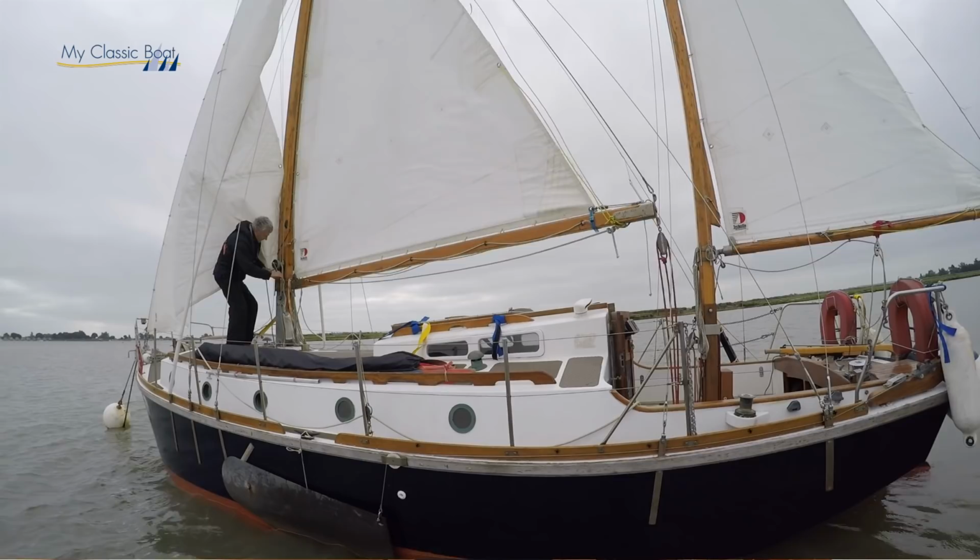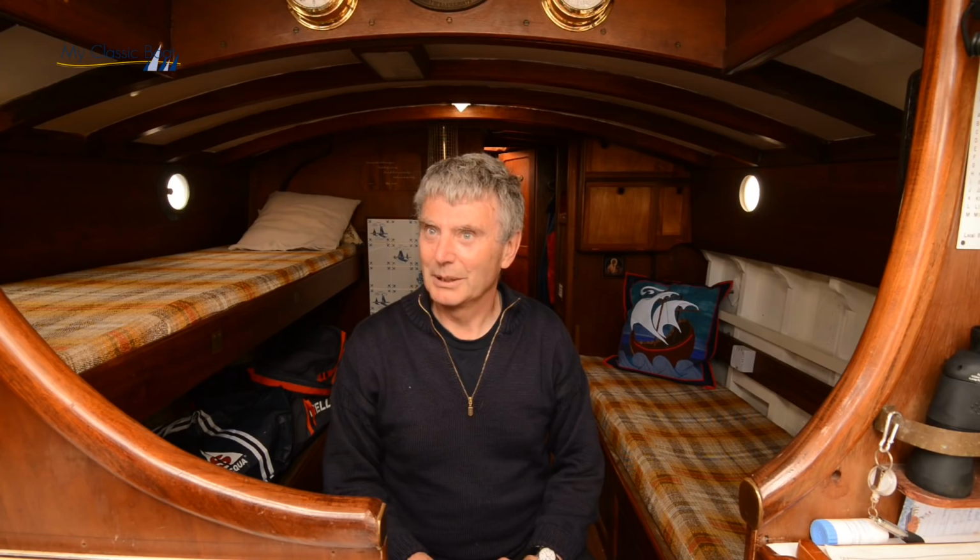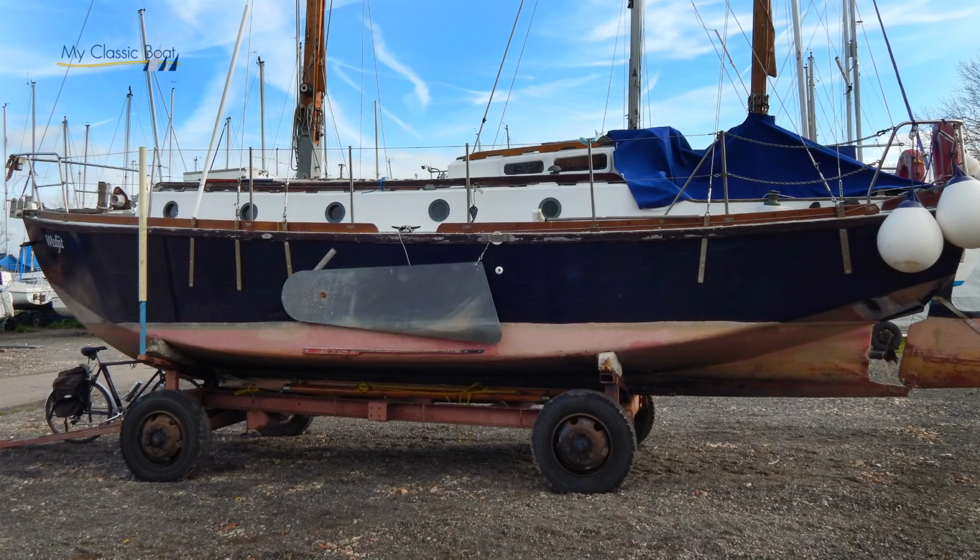So when you're making a plywood boat these days, modern plywood yachts are designed like a monocoque, not like a traditional build with traditional frames and hog and keel and all the rest of it, and then covered in plywood. It's a monocoque. So it's a bit of a heavy dinosaur, but not very heavy. It does have a keel down the middle on the outside. It's about the dimensions of a brick, and that's bolted for about 20 feet the length of the bottom. So when you do ground, you're sat on that.